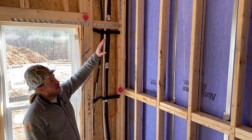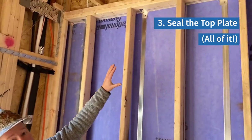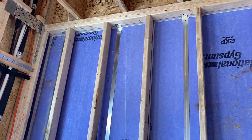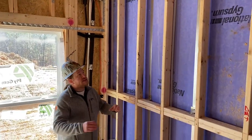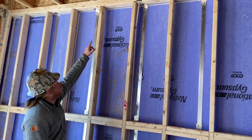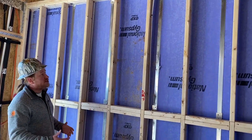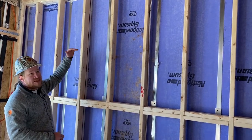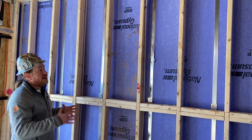The next detail that we want to look at is the spacer along the top plate of the wall. We want to make sure that we're stopping air leakage coming down from the attic behind the top plates. This is another example where they've done a good job — they've put the drywall spacer in there and filled that gap — but they failed to air seal it completely. We can see they ran a bead of foam along the back but left a crack between the wood and the spacer, so we've got about a 50% air seal. We really need to seal both sides to stop that air from coming down through the core wall into the house.